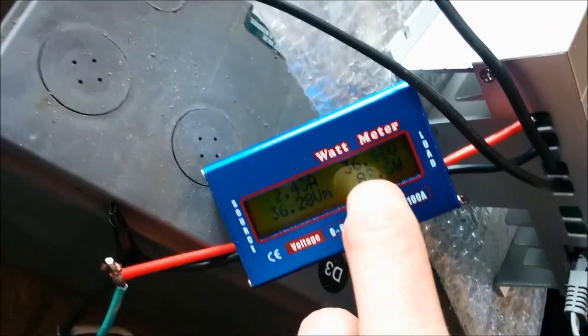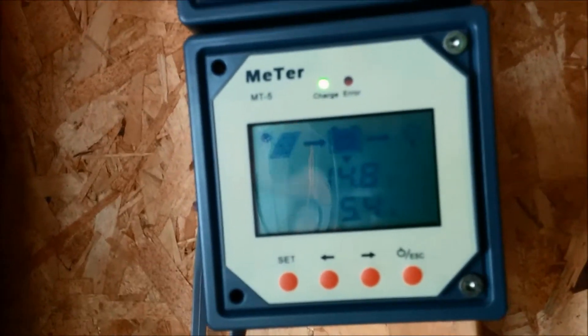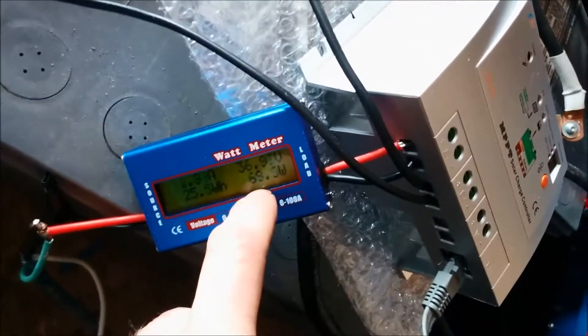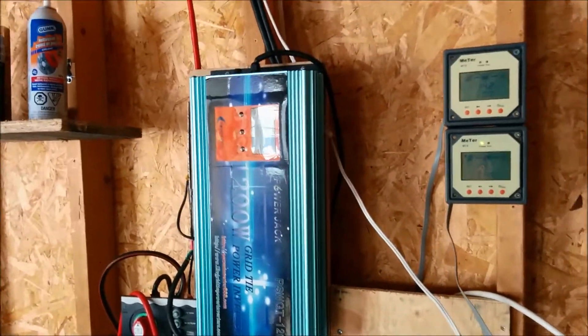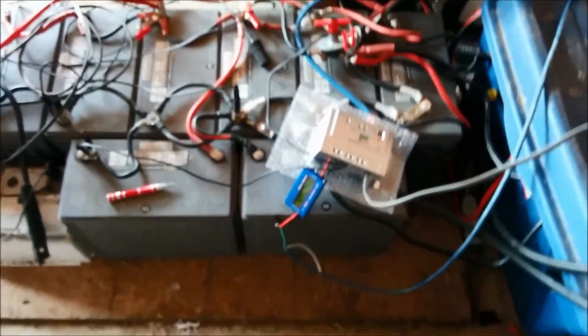Now that it's gotten cloudy, we're only putting in 88 watts — down to 68 watts now. It's at 36 volts and it's limiting the power because it believes that's its cutoff voltage due to the losses in the lines. So I'm getting 80-ish watts. And look at what the grid tie is pushing into the house — it was at 650 a minute ago. That cloud must have just come by. It shows on both of these. Well, anyway, that's the system — it'll be on the Jeep very, very soon. Thanks for watching guys.